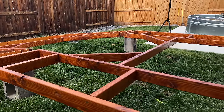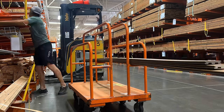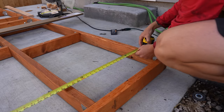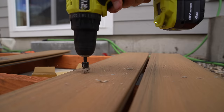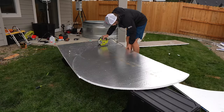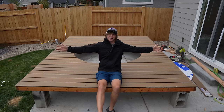Now we have two 6-by-10-foot pieces that can be easily transported on a trailer. Now we need to build a deck — without a deck this is just a big clump of 2x4s. We're not going all Huckleberry Finn with this raft. We have technology — aisle 25 of Home Depot. These are composite deck boards: not cheap or light, but totally waterproof and feel great to walk on. I measured everything with my tape measure, chopped all the pieces, and started putting together the deck, fastening them down with deck screws using a countersink drill bit so all the heads are flush with the surface. Then I traced out the bottom of the tub onto foam to mark the exact shape and used a jigsaw to cut it out. Got that BDE — big deck energy.